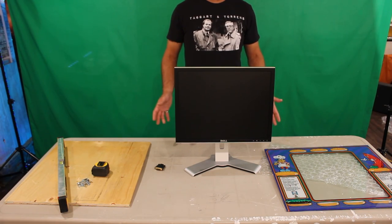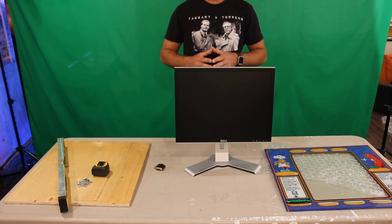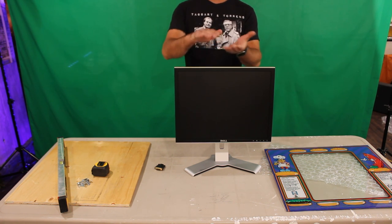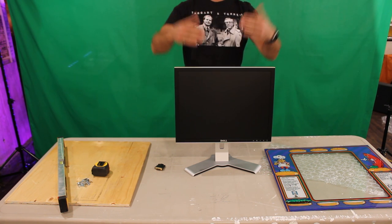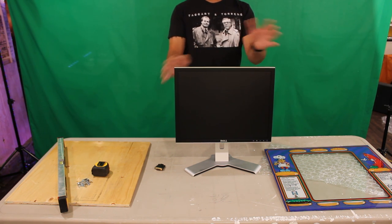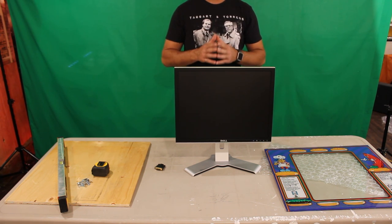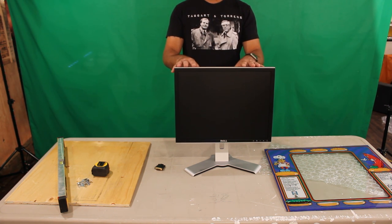Here we have the components that we're going to need to mount this particular screen in that particular cabinet. The parts you're going to need will vary quite a bit depending on what type of arcade cabinet you have. Many of them have a vertical screen layout that's actually vertical when you face it, requiring you to mount this quite firmly. Some cocktail setups have different size screens. The size of the CRT and the shape and layout is going to change from cabinet to cabinet. But this one in particular is quite easy. It's replacing a 19-inch color CRT, and this particular monitor fits that almost perfectly.